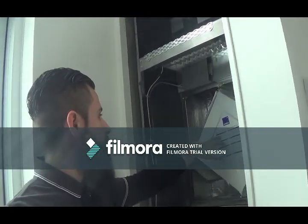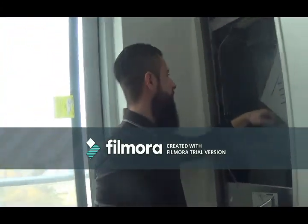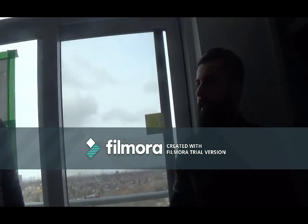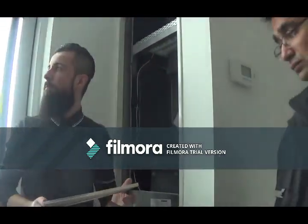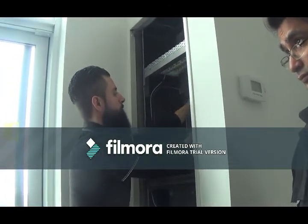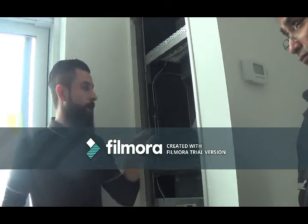Okay, and so you've got the instructions right on here, right? So once a year for the core, and you might need to do a few times a year for the filters. So for this one, you guys or the contractor have to come in here to vacuum those out because the owner can't get back there, right? Twice a year, what they would do is replace the filter, check the drip pan, make sure that everything is clear. They would vacuum inside. They would vacuum those two, the top and the core. They slide out relatively easy, right?